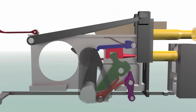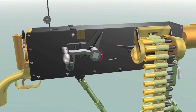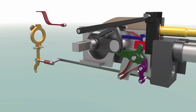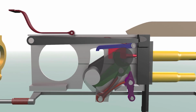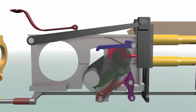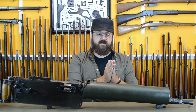Locking is accomplished by a cylindrical crossbar riding in a curving channel in the breech block. When first fired, the barrel and breech block travel together, locked. But that cylinder is turned by striking a projection on the outside of the receiver, tipping it down and free of the breech block. This allows the breech block to carry on rearward alone. Notice this is not quite the toggle arm that we'll see later, despite being a sort of inside-out toggle action, and clearly the same principle overall. The sear and firing pin setup will actually mostly stay the same with minor adjustments, including the out-of-battery safety up top.